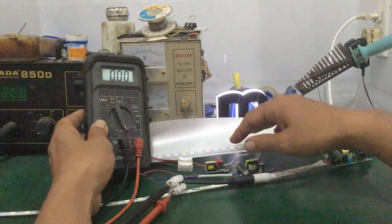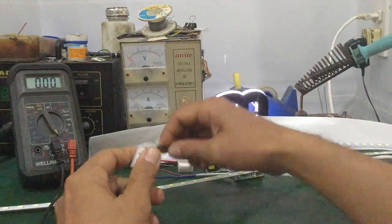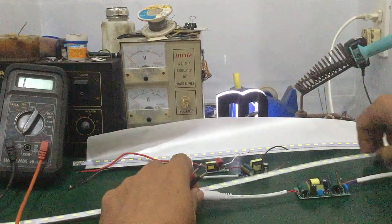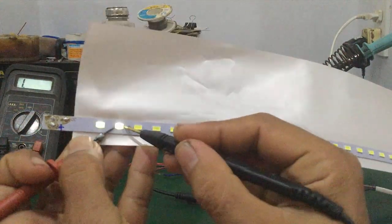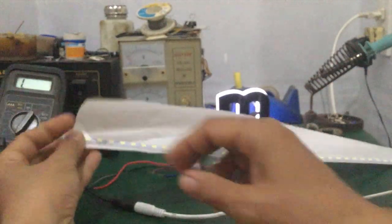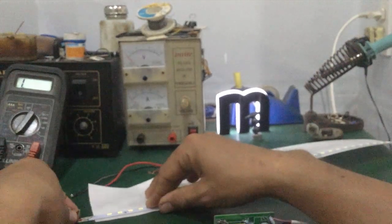I will do a demo for you. With this LED strip that has 2 LED chips connected in parallel, I will try supplying this driver to see if it lights up. It definitely won't light up. I'll measure to show you — this strip has 2 LED chips connected in parallel per branch. In this case, the minimum current to light this LED is about 100mA, but this driver only has 80mA, so it certainly won't light. The strip has 2 output terminals — positive and negative — connect them correctly.